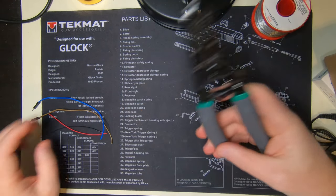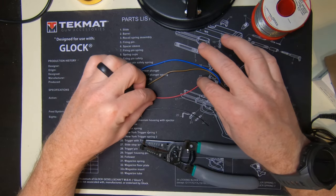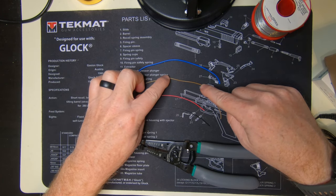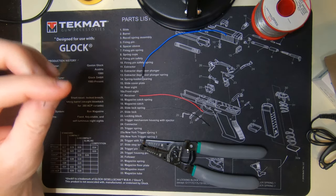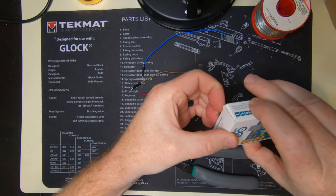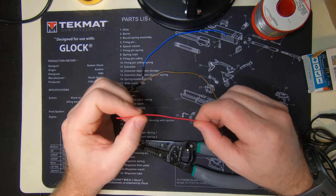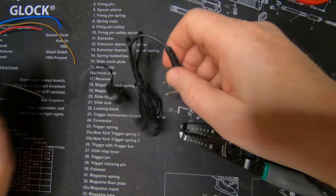Of course you'll need some wire strippers and cutters and a few wires. I went ahead and tried to get the wires the same colors as the schematic on the White Court Amateur Radio Club website that Alex put up. I don't have a purple wire so I replaced it with a brown one. Other than that we've got black, red, and blue. I'm trying to use wire that has a pin made to go into the Arduino pins so there isn't a short, and the wire gauge is big enough to strip down and insert as well.